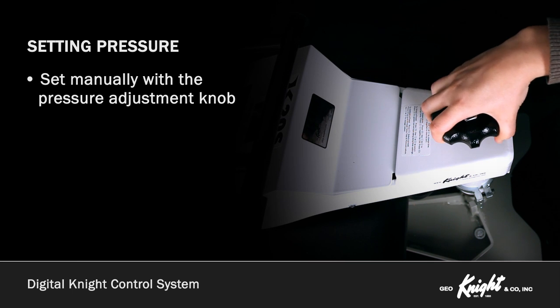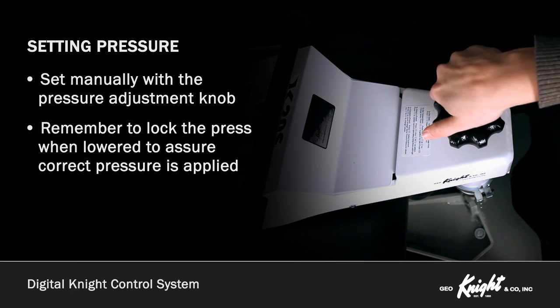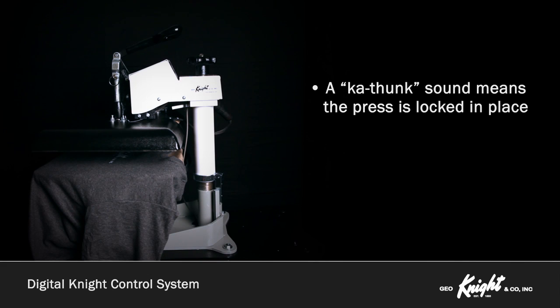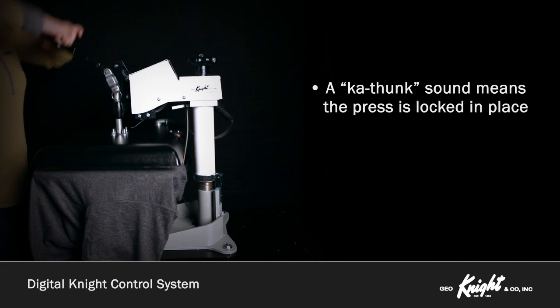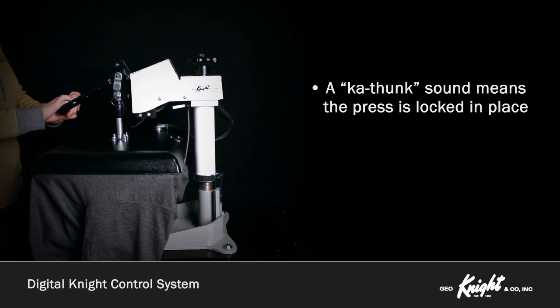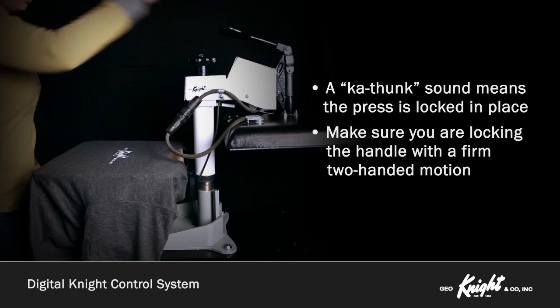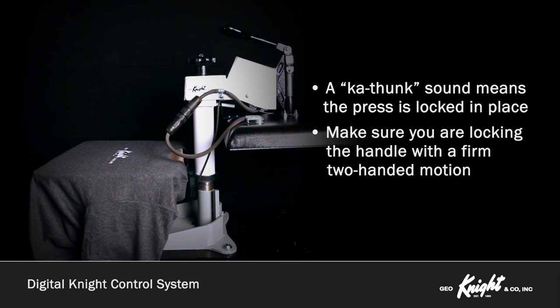It is imperative to remember to lock the press when lowered to assure that the correct pressure will be applied. The basic rule of thumb is, if you hear a ka-thunk clamping sound, then you know that the press is locked in place. If you can lock it easily with only one hand, you may not have enough pressure, so make sure you are locking the handle with a firm two-handed motion.